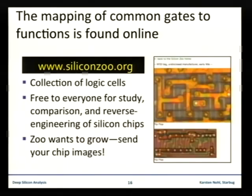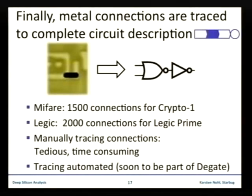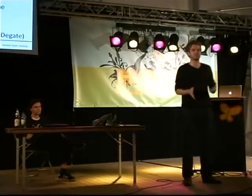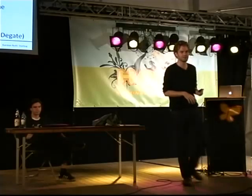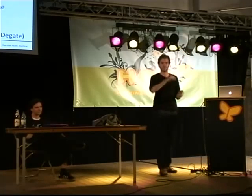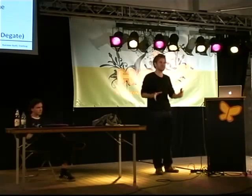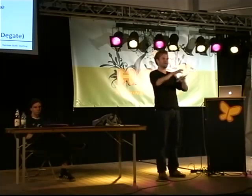We tell the face recognition software: this is a face, this is a face — where are other faces in this picture? And it will find all of them. We do that for every single logic function and we get a map of where on the chip each logic function is. That doesn't yet tell us what these logic functions are, but at least we know the families and where they are spread out. To find the functions themselves, we look into one of these cells and figure out how the transistors are connected. To anybody who ever did VLSI design, this is trivially recognizable as a NAND gate — you can see the same setup of four transistors in each of those cells.